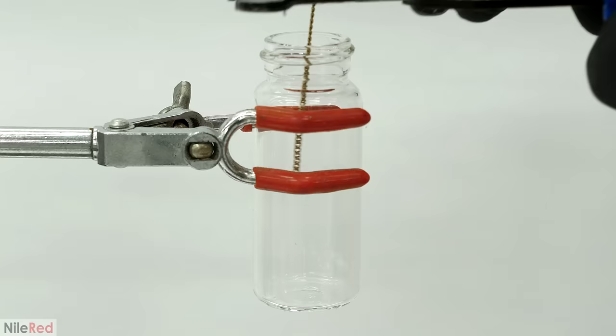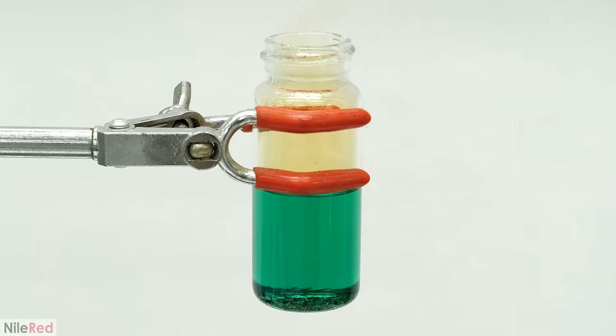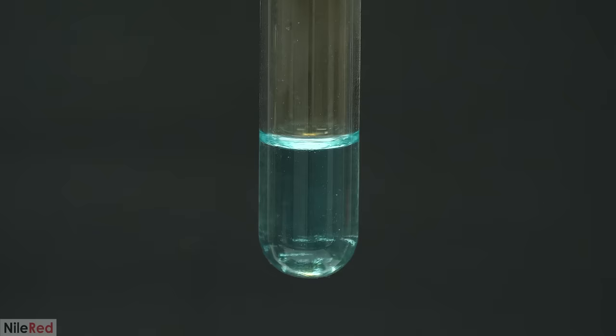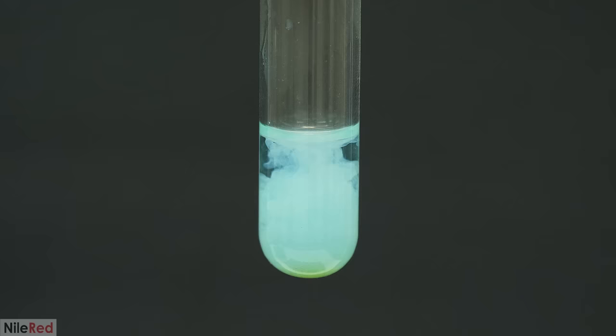Using the same test with a piece of the smaller chain, it was a different story, and the acid immediately started attacking it. It also changed colors, where it was initially blue, and then it slowly shifted to being green, because of all the copper nitrate that was forming. About 10 minutes later, there was almost nothing left, and it was mostly just some light black flakes. From this, I took a small sample, added it to a test tube, diluted it with some more water, and added some concentrated hydrochloric acid. Almost immediately, a whole bunch of white stuff appeared, which was probably silver chloride. This told me that there was silver present, and that the chain was probably just a mix of copper and silver.